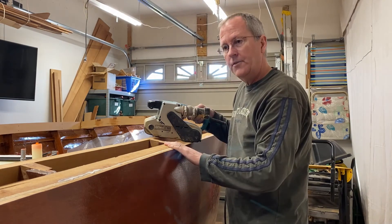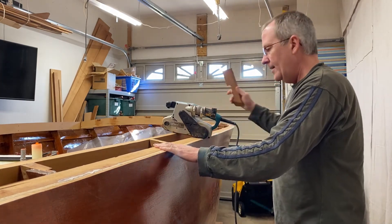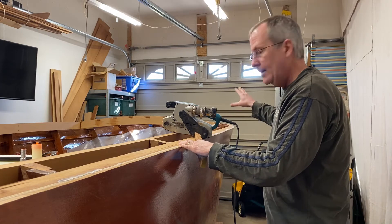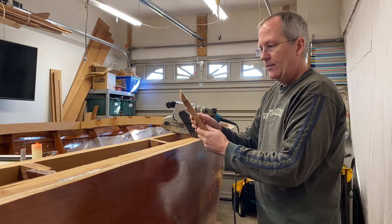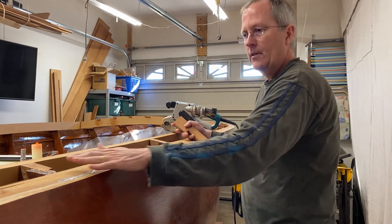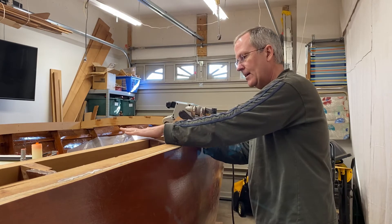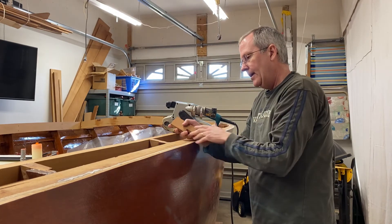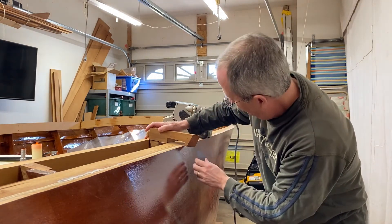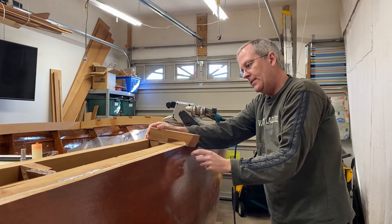To find out how far down to take this, I made a little jig with a notch cut out of it. What I could do is lay it on what's left of the deck beams, because that's the angle you want. These deck beams go like this — you just want this to go right down all the way out to the outer edge. To visualize that, I made this jig with a little piece, and then this surface is on the same plane so you can see how close you are to it.